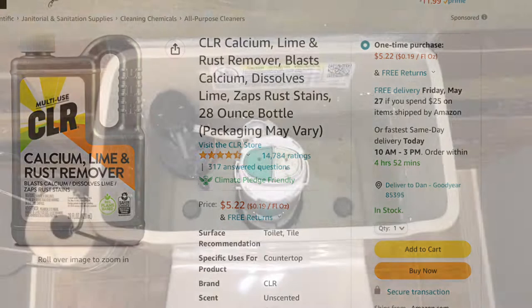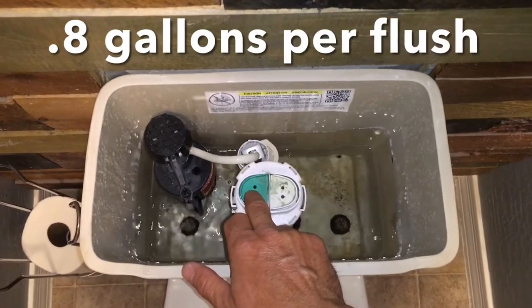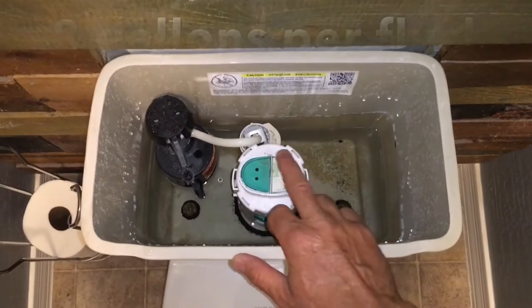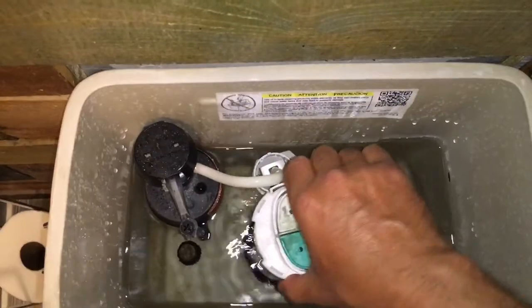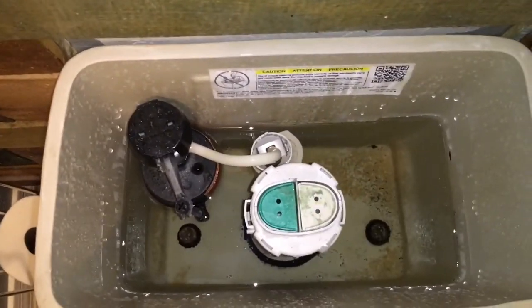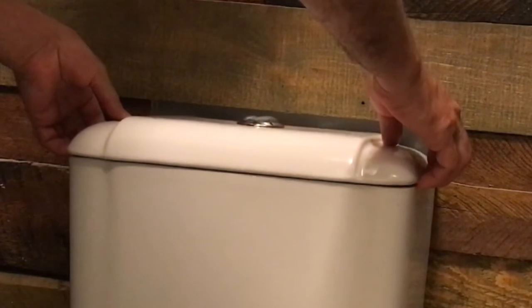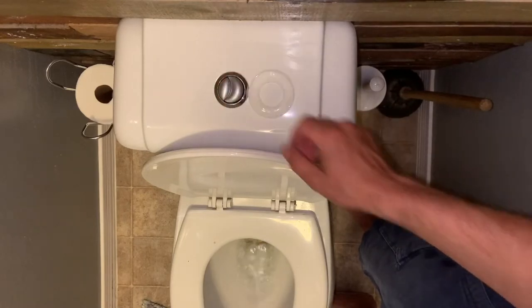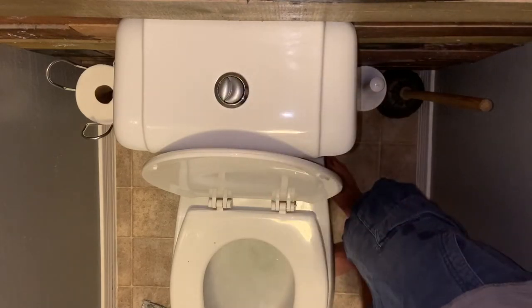Phones are great devices to take pictures as you take stuff apart, so you can make sure you put it back the same way. But if you did forget, you could push those flush valve buttons and see which one empties the tank halfway and which one empties it all the way, and that will help you determine which way the flush valve goes in. If they are reversed, all you have to do is twist that flush valve around. When setting the lid back down, make sure you do not slide it into place because the rods could get caught on the flush valve and snap. Then verify your repair by flushing it a couple times — everything was good, and that's all there is to replacing the flush valve seal.